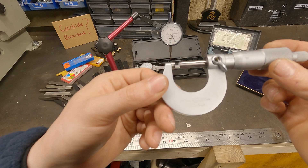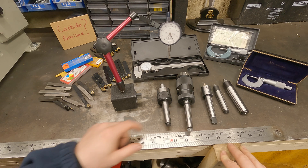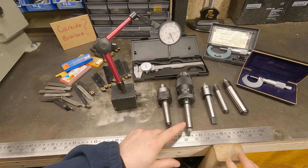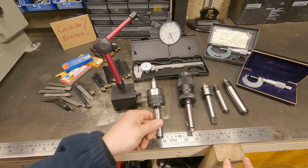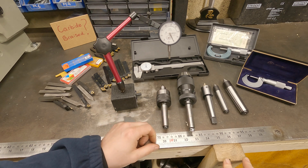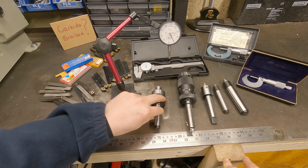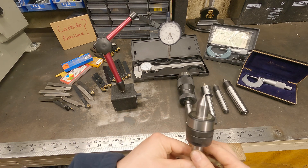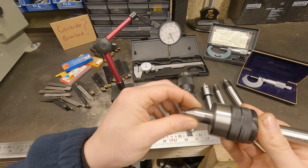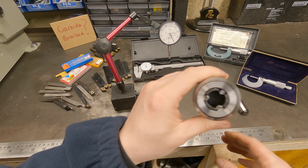The last bit of tooling I recommend when you first start out are these Morse Taper 2 attachments. In the first video I told you about the tailstock — the tailstock on my lathe uses a Morse Taper 2, and I would say 99% of Chinese mini lathes are also going to use a Morse Taper 2. There's quite a few different tools you can get to fit in there. This right here is a live center — it spins the middle bit and keeps the outer solid, which is really good if you want to add support to the end of your work. I've also got this keyless chuck.